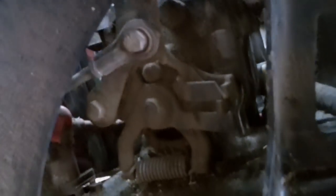Once you get the pulley completely off, you'll look right here. The bolt that holds the pump on is actually like a stove bolt, which is pretty cool because you don't have to have a backup wrench on the top side when you loosen the nut from the other side. Let's get all the linkages disconnected from the pump and the hoses and we'll get this pump out of here. Remove this bolt here — right behind there is the shock absorber for that. Just take a small pry bar and pop it out of the way. Getting this pump out is pretty straightforward.